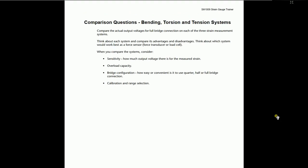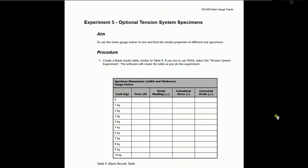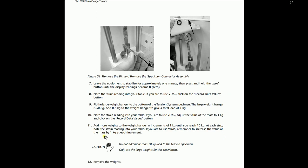You can easily compare all the strain gauge readings. Now moving to the results sections. Starting with experiment number 2 results, as I have discussed the results of experiment number 1 in earlier stages. Don't expect the readings to be exactly the same — they will be nearly the same. For example, if the strain gauge gives a value of 13 microstrain, it might give you 12, 11, or 14. Don't worry, because the working conditions under which these readings were taken are different from your system.